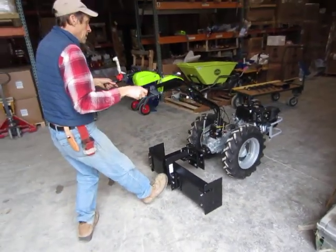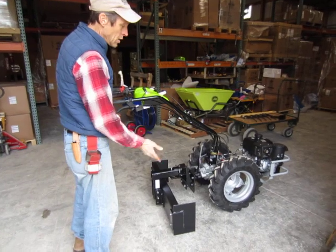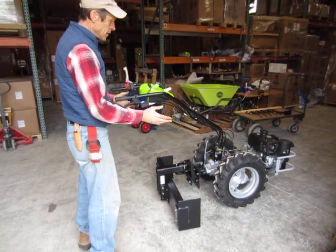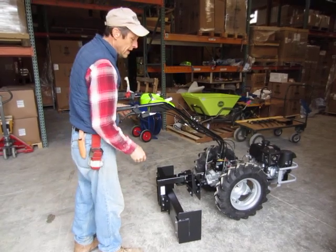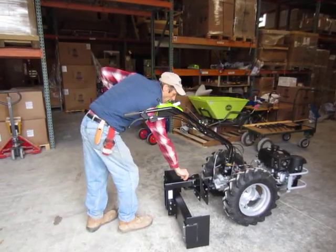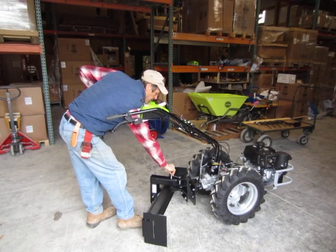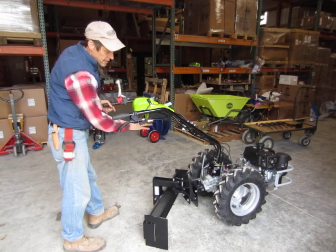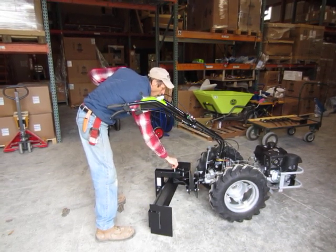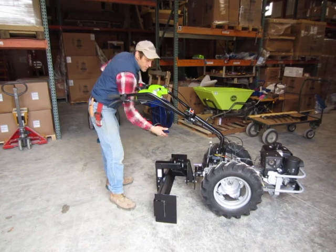So we'll slide this pin — okay, we've got a nice scraper blade. This is the scraper blade configuration, meaning you're pulling it behind the tractor. You'd typically want the box ends on there because if you're leveling gravel or dirt you can pull a lot more material without it escaping around the sides. They're two bolts on each side to remove them. If you want to cock the blade you just pull the pin and cock it however much you want — there are two offset positions in each direction plus center, and it just drops in and stays there by gravity.